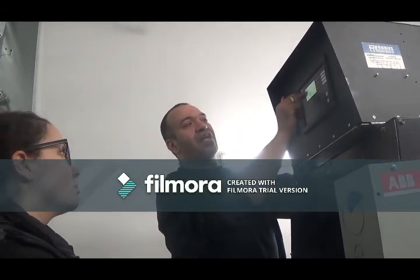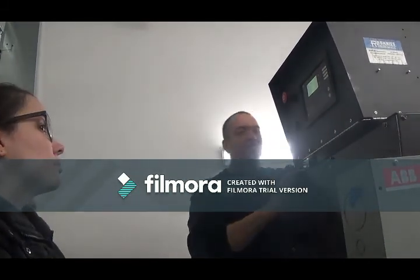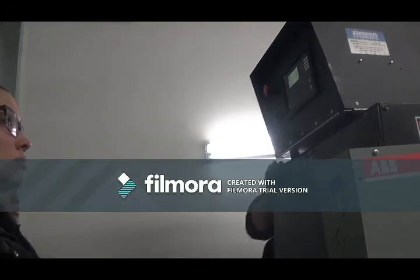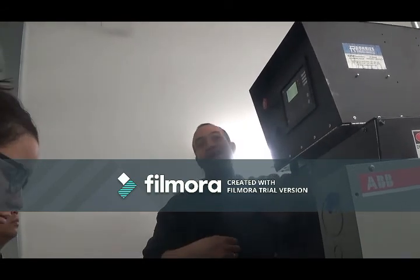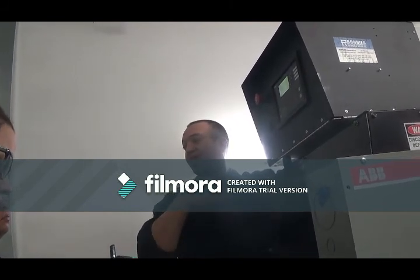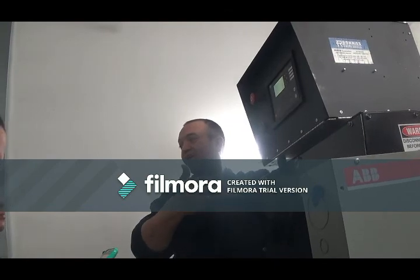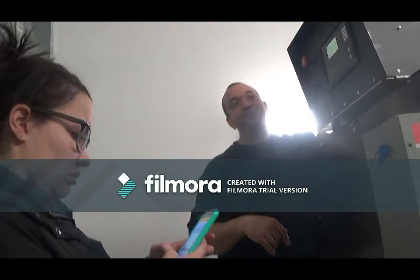Your voltage, line one to neutral. Let's say it's a 600-volt unit, I haven't checked. You will have 347 volts. Basically, a 600 to neutral is 347. People think about half, but it's 347.